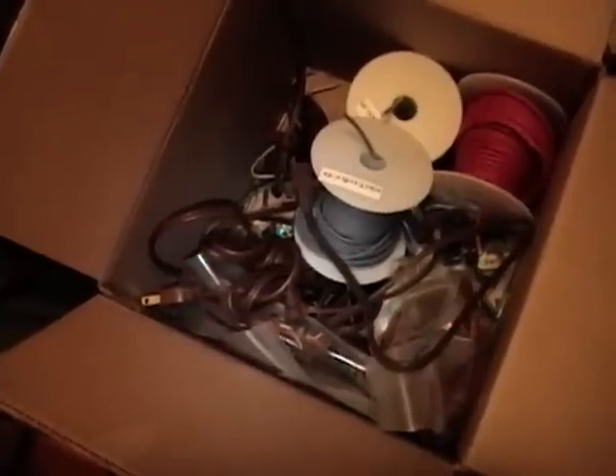One last thing — I'm going to grab the new power cord and plug and give you an idea of what that's going to look like. Here's a box of reproduction antique stuff I got not too long ago, like cloth-covered wire. Here's the power cord: it's two-conductor, rated for modern line voltages, with a nice round cloth covering. As for the power plug, I've got two styles — a rectangular type and a round type, both pretty classic designs. I'm not quite sure which one I'll use, but either one I think will look pretty authentic.